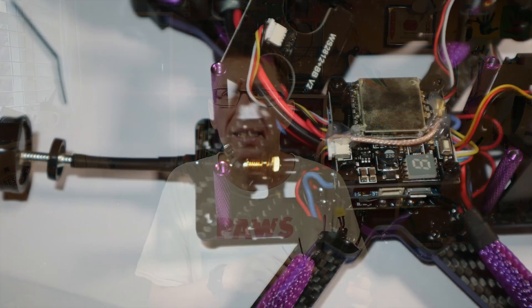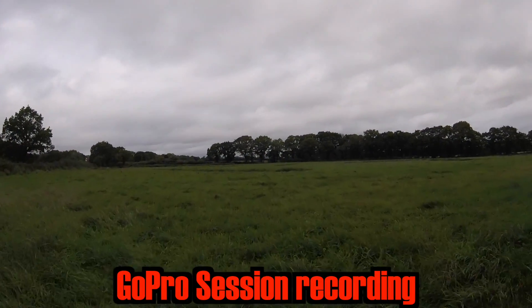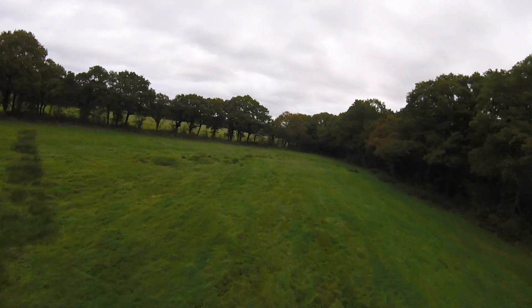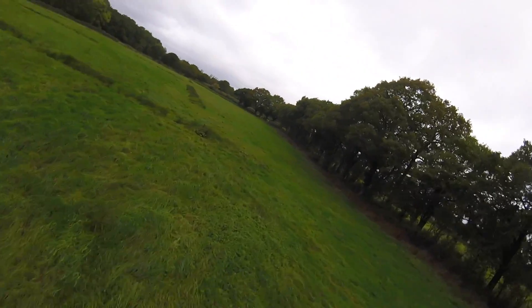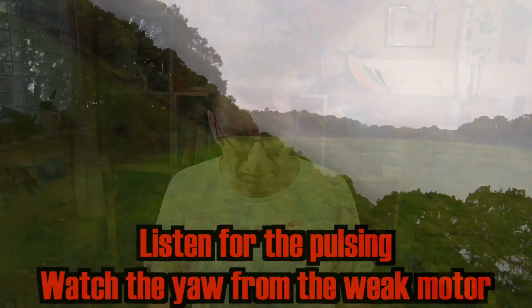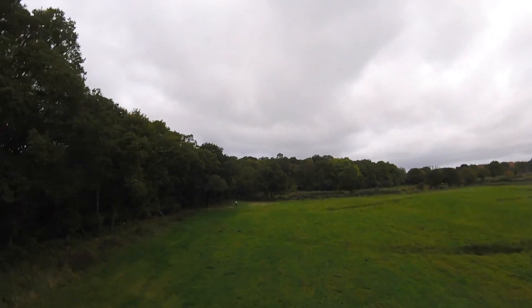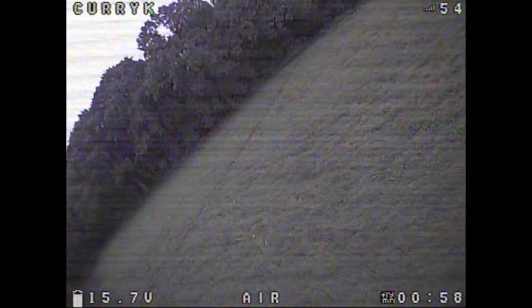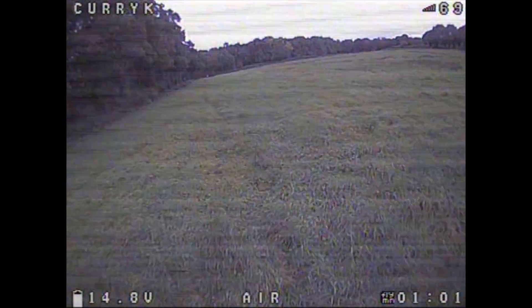After turning it 180 degrees, the UFL to SMA pigtail doesn't quite reach, so rather than bring the SMA antenna up here I've just zip tied it on here so it's nice and secure. I also glued the pigtail down so it was more secure and couldn't vibrate off, then put it all back together for a test flight. It flew, but there was still an issue — at low throttle it looks okay, but give it more throttle and you'd hear the motor pulsing and feel the back end dropping, exactly where the motor I just replaced is. On the FPV view the noise issue is still there — still full of interference. I brought it down and felt that motor and it's warmer than the others. Not hot, but it only flew for a couple of minutes, so that's a bit of a problem.